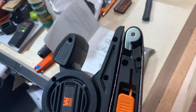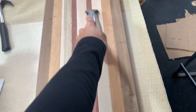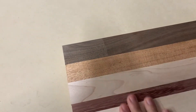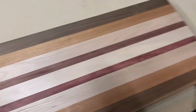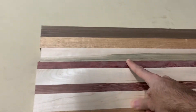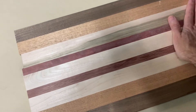You can also use a belt sander — this is a pretty good unit, around 40 dollars, I'll put a link to that. This paint scraper is really good for removing glue — link in the description. After running it through the thickness planer, I have a tiny bit of snipe which is a non-issue and will come out during sanding. I got this on an MDF board pretty flat with no rocking. Even though my glue-up had a little bit of variance — this piece of maple had some pith or heartwood in it — milling it down brought the board to an acceptable size.